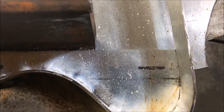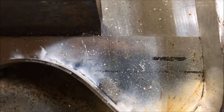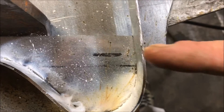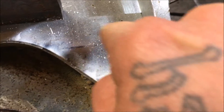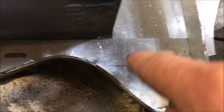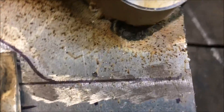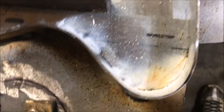What's up fellas, I'm in the middle of doing a little bit of fabrication here on some new burner designs. I know I'm just beating this thing to death, but an amazing idea came to me. We're going to try out two different burner shapes. We've got our divergent-convergent shape here — waste oil will come in this direction, and I'm hoping to induce a vortex in this area to continually ignite the flame. That's a very important feature of the elbow burn, so I'm trying to replicate that in an extremely easy square setup. This is going to be a square waste oil burner.